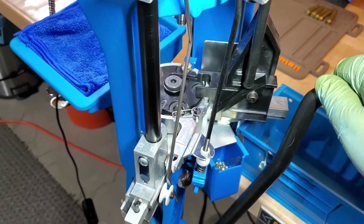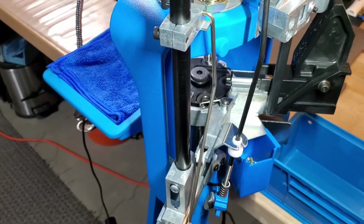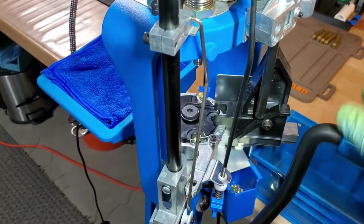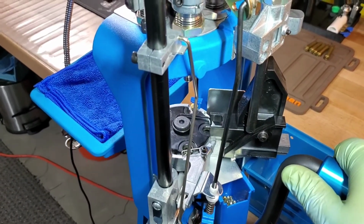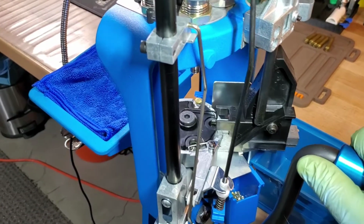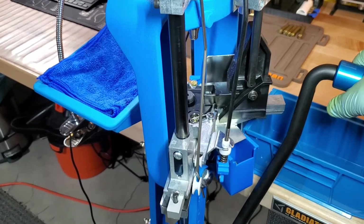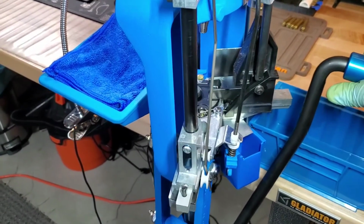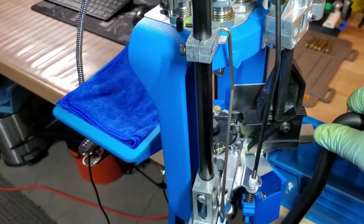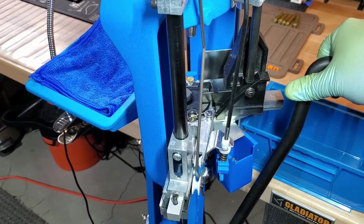The biggest thing for me was that if you don't seat a primer, it essentially stays there and is waiting for the next available piece of brass, and you can seat it. Whereas on the 650, it's got the rotary dial system, and that live primer goes into a live primer chute area. I'll show you in just a second. So that's the huge difference on the 750. It's also a lot quicker to change from large to small primers, or small to large.